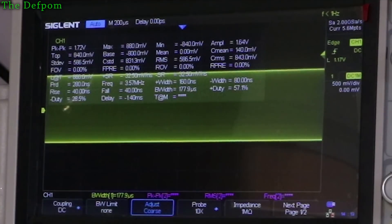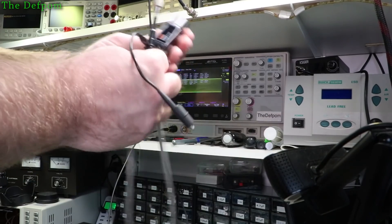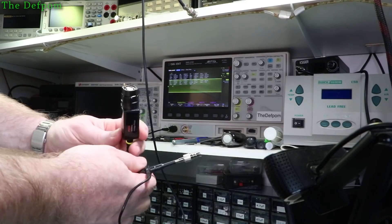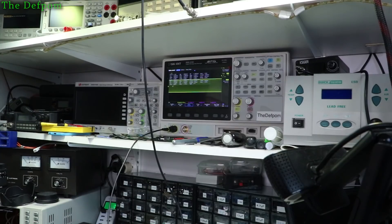Yes, these cover high frequencies better, but don't cover anything below 100 megahertz properly, it would seem. That's weird — so maybe I wouldn't recommend these particular ones, because this doesn't really do what it's supposed to do. It's not DC flat to 500 megahertz. Yes, it goes up to 500 but it ain't flat. I wouldn't recommend it. If you need something which still has high frequency and you're not worried about low frequency, then maybe it'll suit you, but I'm disappointed.